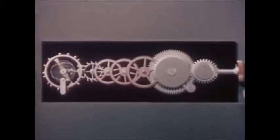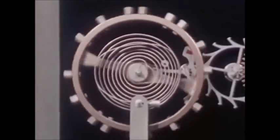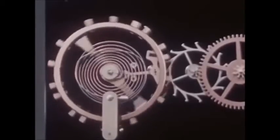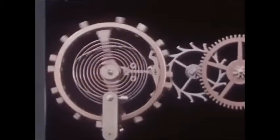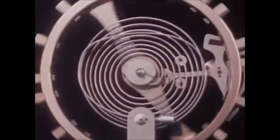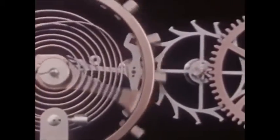What we have now is a complete model watch train. Through the gears, the mainspring drives the escape wheel. The escape wheel teeth push first on one pallet jewel and then the other. The pallet fork nudges the jewel pin on the balance wheel to keep it moving. The swinging balance wheel on its return trip moves the pallet fork, which unlocks the escape wheel to release a little more energy from the mainspring. Back and forth the balance wheel swings, controlled by its small coiled hairspring in perfect rhythm. Each swing unlocks the escape wheel so it can give an extra push to a pallet jewel, keeping the watch ticking far more steadily than any beating heart.